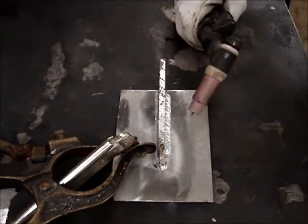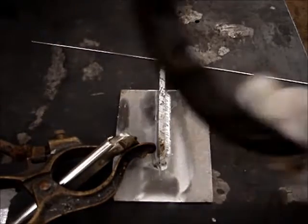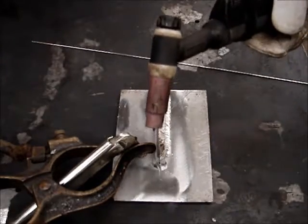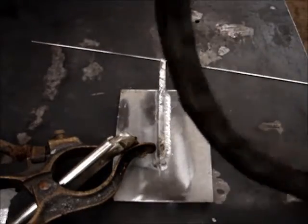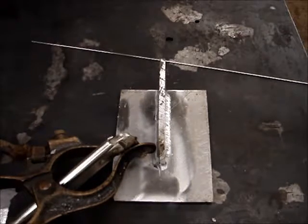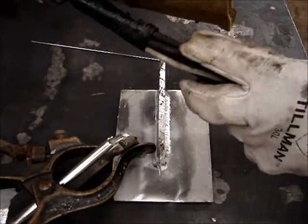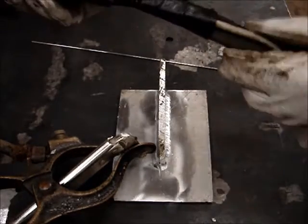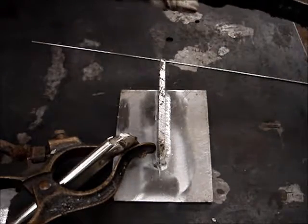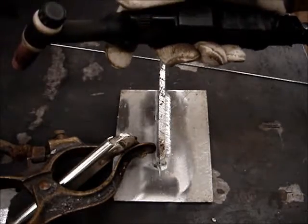That was like this. Now, things you can do also is you can take this big heavy cable, which is, this is the 300 amp torch, so it's got a big hose here because it has a power cable that goes up to it. It has a supply and a return of coolant, and then it has this tan grayish colored cord here, which is actually the one for setting the amperage on the torch.